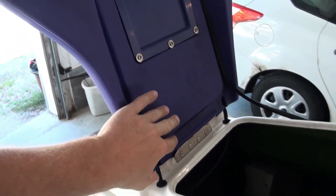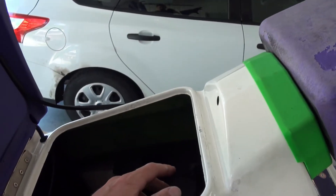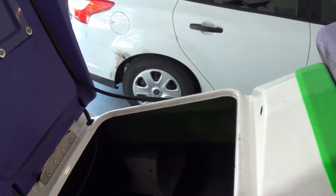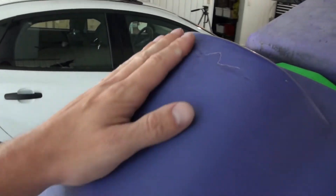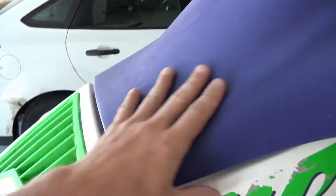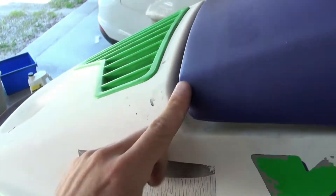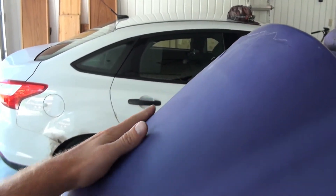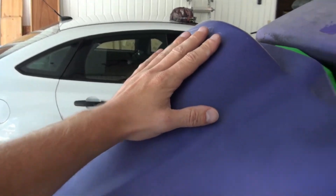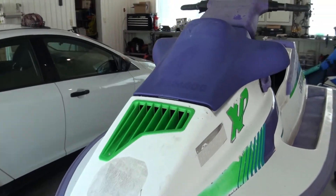So let's say the hull gets filled with water — we don't want to be sucking it through there. That's going to get blocked off, and instead the fuel tank is going to get its air from way up top on this hood. This hood is hollow — see, it's cracked here, I've got to fix that. This hood is hollow, and there are points at which air can come in but water can't. It's hard for water to come up in there, so this is all filled with air. The fuel tank is actually breathing through this hood.